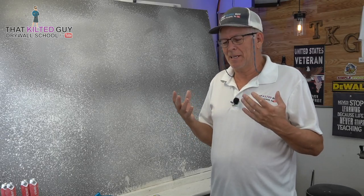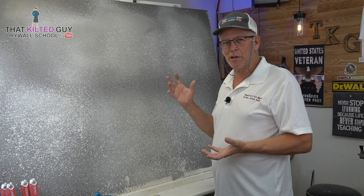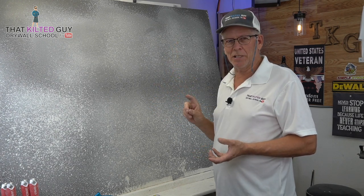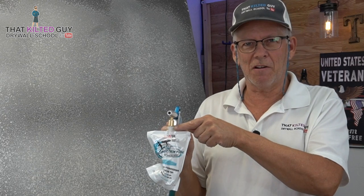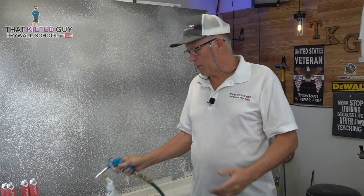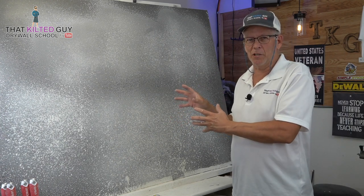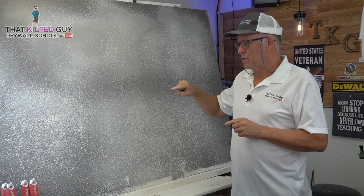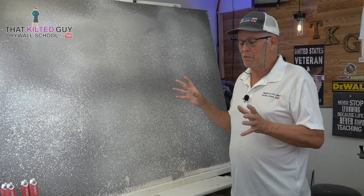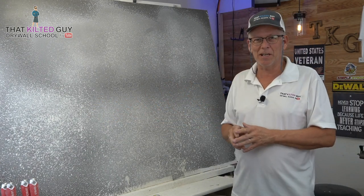I found that canned texture costs way, way too much — it's just too expensive. Once in a while go ahead and break one out for a repair, but if you're looking to do this much at all, or you want to save money in the long run, this EZ Pro is going to be a lot cheaper. The rest of that texture in the bag is still good — it's probably not going to go bad unless it sits a year or two, so you don't waste near as much material. I think you can get better control over what you're trying to do with this. I actually screwed up — I didn't turn down the pressure to 30 PSI for knockdown because I forgot, but by squeezing it fairly firmly I still got quite a bit on here. We're still going to get a knockdown look out of this.